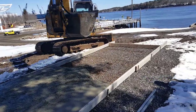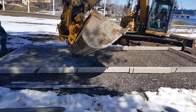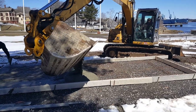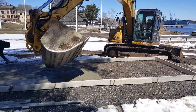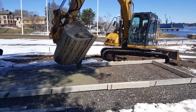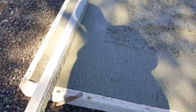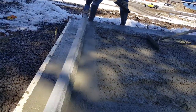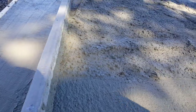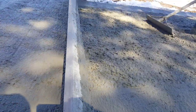The sun was out just enough to loosen up that stuff and keep it from being frozen really hard. Now we had the pads covered with blankets so there was no frost under the pads — we were good there. We came up and formed these up the day before and it was really really cold. We thought we'd be able to back right up and dump them out quick. The concrete has hot water in it and accelerator — we really pounded the accelerator to it.